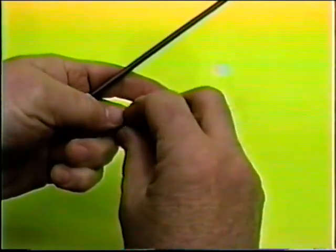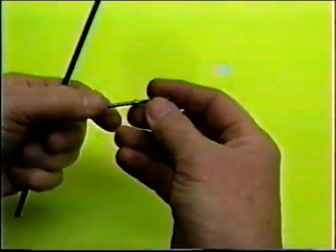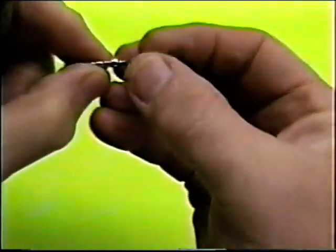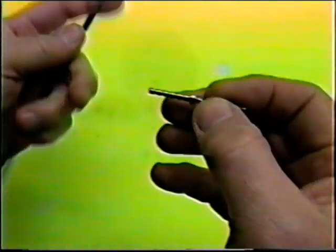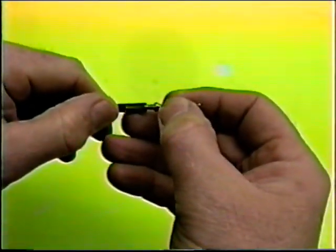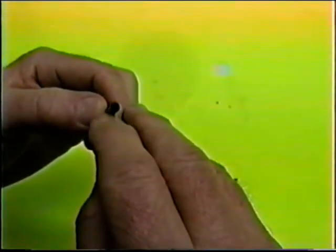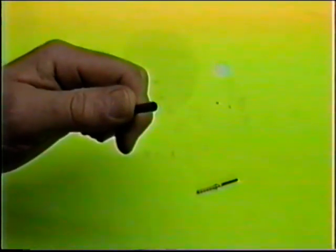While Les is working on putting his trailing edge and that spar joiner in, we're going to set up this titanium end from Tom Morris. It's the most important thing, which is why I'm putting it on the video over and over again. We had made one of these already, and we tried to pull it apart, and it really was looking like it was going to be strong enough. But the most important thing, two things, are to get things rough before you use JB Weld. And we just happen to have this nice little tool here.